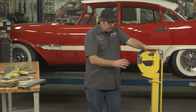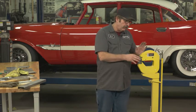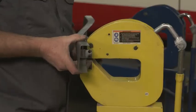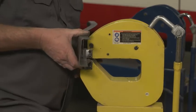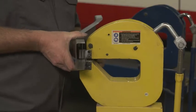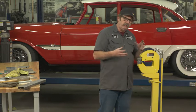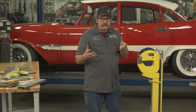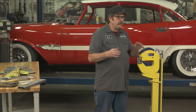Let's explore the stretch first. Basically what's going to happen is the metal is going to be pulled apart in small increments, and that allows us to form contours in pieces of metal that you couldn't normally form. I've used shrinkers and stretchers to fit various metal parts — when you get patch panels, they never fit quite right, and a lot of times I need to go in and shrink and stretch in certain areas to get a better fit.